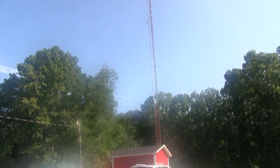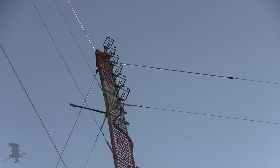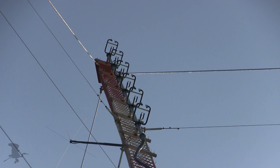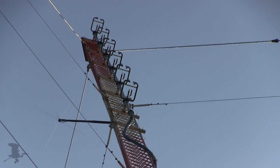Here's my radio station and here's the antenna we're having problems with. I thought I would just send the drone up quickly to do a proof of concept, but it turns out the footage was all they really needed. I can show you where it was flying and how close it was to the emitters. I had to fly in between those guy wires to get a shot of those transmitter emitters. Each one of those bays is part of our FM transmitter, and one of them was showing a hot spot that we wouldn't have otherwise seen without the FLIR.